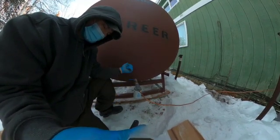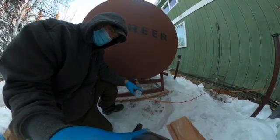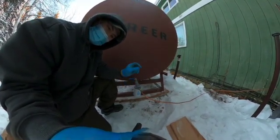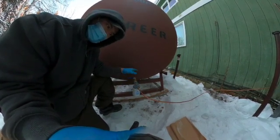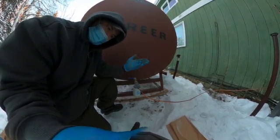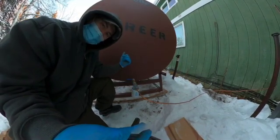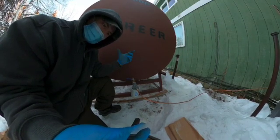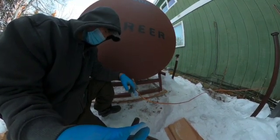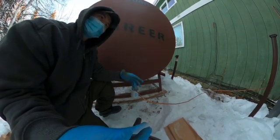Monday they're going to have fuel brought over, so I'm going to leave this off. On the other side of this fuel line I have a plug in it so that if this is leaking or whatever, there's no way that fuel can get into the boiler room or into the building. I also put on the fill cap on the top and the vent cover, and then there's another plug up there. So all that is good to go — we're all set here.